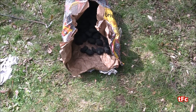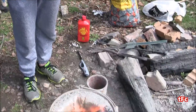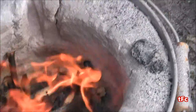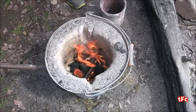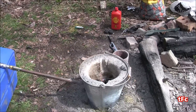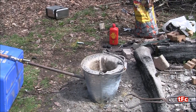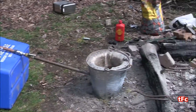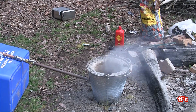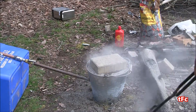To power this foundry I'm mainly using charcoal briquettes — just small pieces of charcoal that burn very hot. I'm going to start throwing a few pieces into the burning fire; these catch on fire pretty quick. After a few minutes I'm going to turn on a vacuum and the charcoal will really start to get hot. About five minutes later, we're ready to turn on the vacuum. All that stuff coming up is just ashes from running the foundry previously.